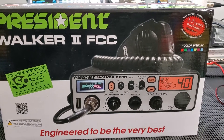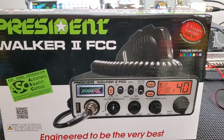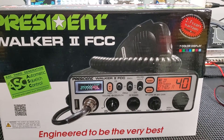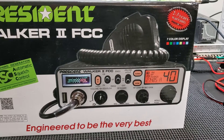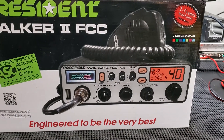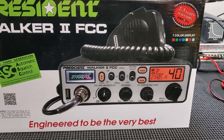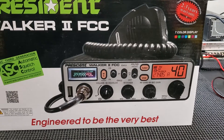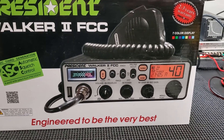The Texas antenna is really tall, which is the only downside — to get a better performing mobile antenna you have to add more height to the whip. I'm assuming it has some way to tilt it; maybe you could tilt it at 45 degrees if skip was running. Right now I'm running a Browning NMO-style CB antenna, and I have a Wilson I could put on with an adapter, but I don't care for running that NMO to SO239 adapter — it's clunky looking. It's better to have a permanent mount through the roof.